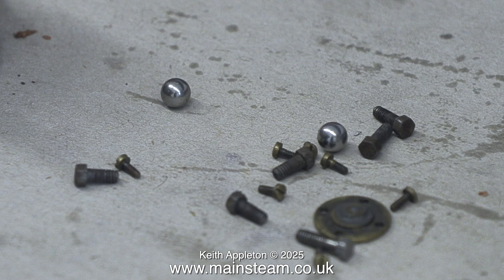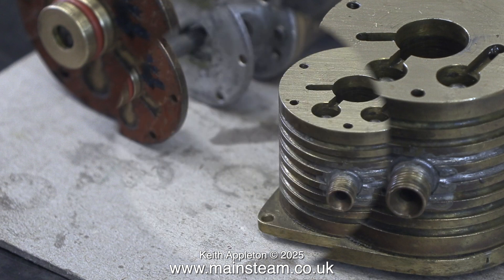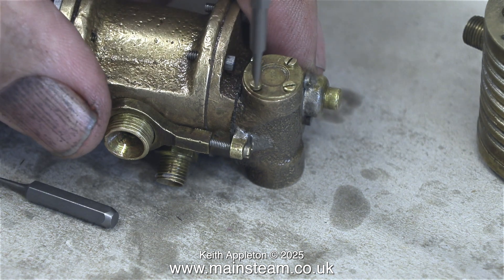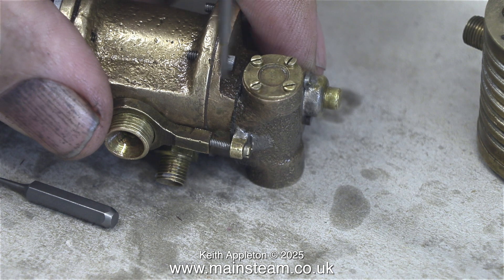I really am worried about these very tiny machine screws because if I drop one on the floor I can't use my magnet to pick it up — my working limit is 10BA. I think these are possibly 12BA and they're far too small for my eyesight these days, even with a magnifying headset. I can't say I'm too impressed with the quality of the soldering on the main body of the pump, but I'm sure it doesn't leak so that's all that we need. Now it's time to hold my breath and hope that I don't get a muscle spasm as I screw these very small slot-headed bolts to secure the end caps on the shuttle valve chamber.